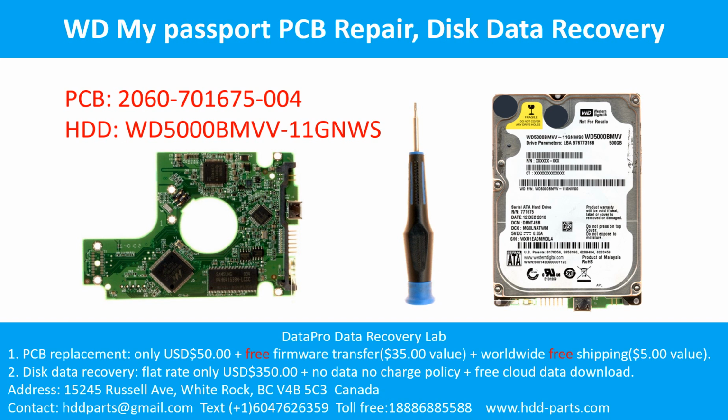Hello there. In this video we are going to talk about the WD My Passport external hard drive, the printed circuit board repair, and the disk data recovery. For this case, the printed circuit board number is 2060-701675-004. The hard drive model number is WD5000BMVV-11GNWS.